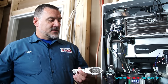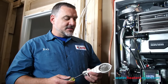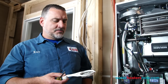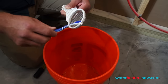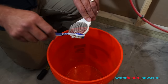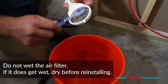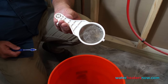So we have the cold air filter removed, and as you can see there's a lot of debris inside there — some from construction and some from bugs. So we're just going to dump that out into an empty bucket and clean it out with a toothbrush, then reinstall the air filter. You don't want to get this filter wet as you're doing it. If you get it wet, that can actually give an error code on the water heater. So we just want to use a dry brush, get all the debris off of it, and then we're ready to reinsert it.